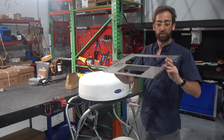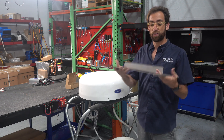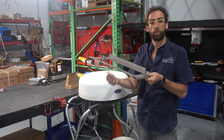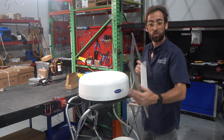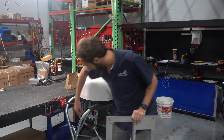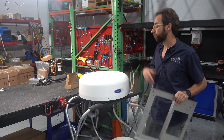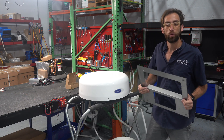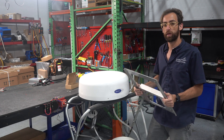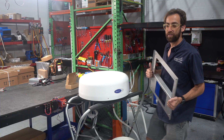The boatbuilder can decide what to do with the interior side — whether to vent it or modify it. It can be mounted just like this, blowing straight down and returning straight up. Installation is just the cutout, running hoses to the top, and finding placement for the digital control. We still have seawater cooling, so you'll need the through-hull and pickups. The pump that comes with it can handle up to 25 feet of head, so we don't foresee any issues reaching hardtops.